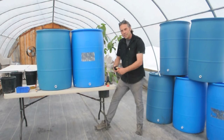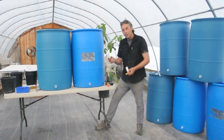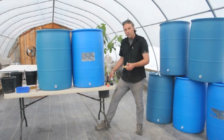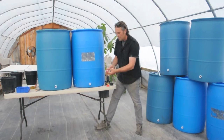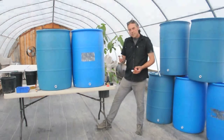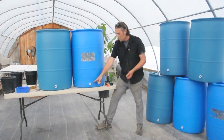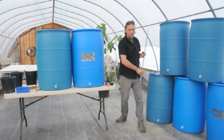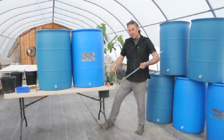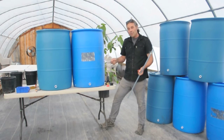The only issue was that our faucet had to be a three-quarter-inch faucet, because we couldn't find a coupling system like this that fit the half-inch faucets that were supplied. So we upgraded the faucets to three-quarter-inch thread on one side and three-quarter-inch garden hose on the other. This fits in nicely — it's definitely tight and water's not going to leak out. It is challenging to get your arm as low as where the holes are drilled, so we used devices to lower things in and a wrench to tighten from the inside, but it's still not very easy.